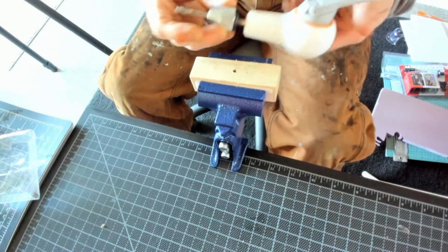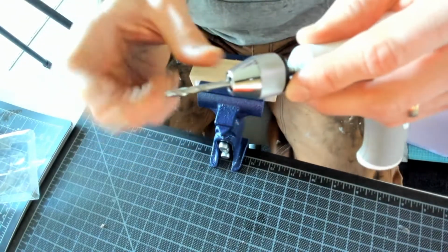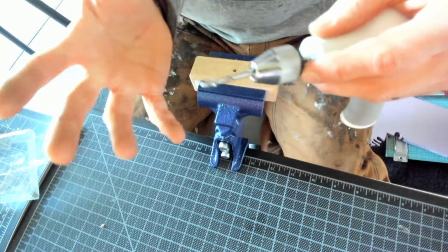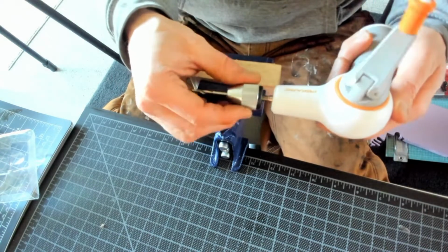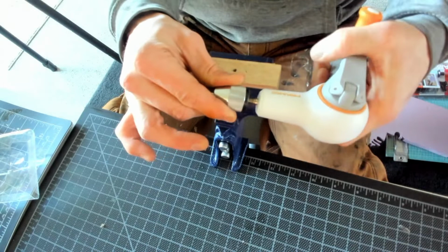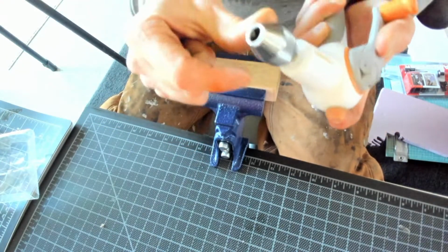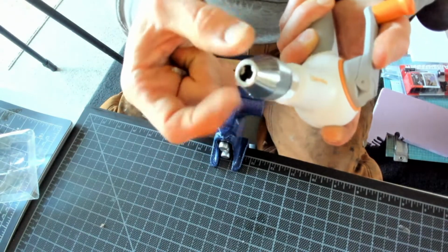I've got my tool here, so I've already taken this one out of the box. Let's show you the parts. It came with a set of 4 drill bits, twist drill bits they're called. When you have multiple drill bits of different sizes that are sold together, they're called a drill index. When I move the chuck around, you can see that the handle moves. So to loosen the chuck, I'm going to have to hold the handle securely so that it can't spin on me. And then I just twist the metal out here. And as I twist, the little teeth inside will come in or out. Here they come.